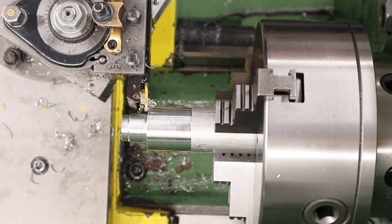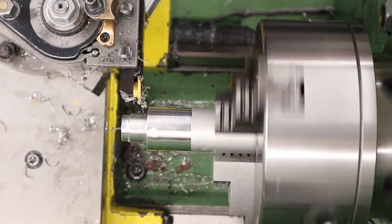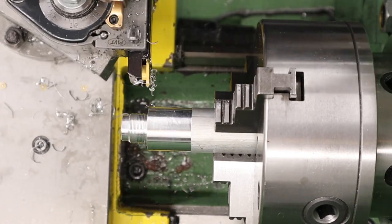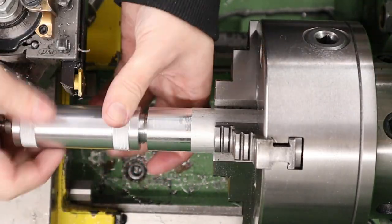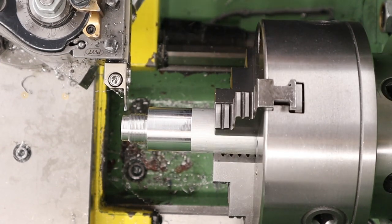There is going to be an O-ring on this end to stop reg pressure from leaking out through the threads, and this will seal on the same bore as the regulator. Next up we can put the thread on — the thread's going on nicely. It's a fairly fine pitch but the thread's long enough to be nice and strong and it's definitely not going to blow out under pressure. Once the threads have been established we can test fit the other part and make sure it's fitting on nicely — and once we're happy we can just polish the threads up with some scotch-brite.